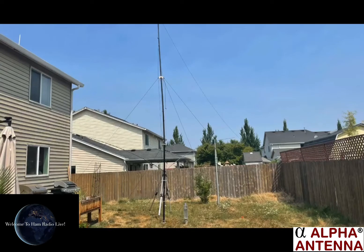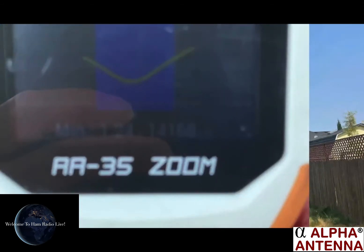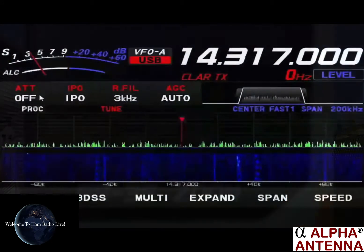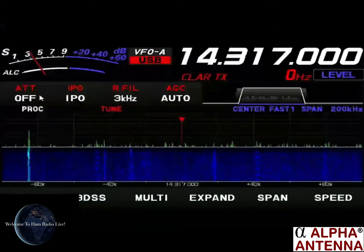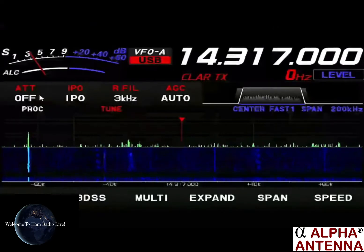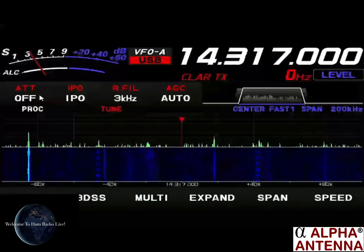The Hex Tenna is right behind it — you can see the two wires extending out in the form of a V. It's running in the dipole position on 20 meters. The SWR today is 1.24 at 14.16 MHz. Keep in mind we're at a kilowatt, about 20 feet away on one of these whips. Reflected power is basically nil — very limited reflected power back on this antenna. It really works.